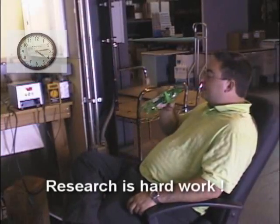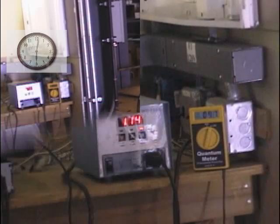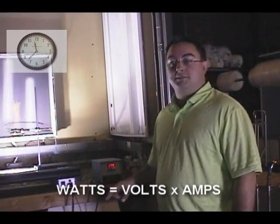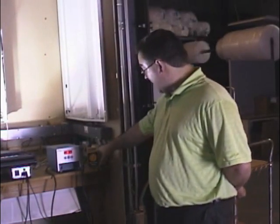After the time-lapse, you can see from the label that it's marked as 2.35 amps at 120 volts. Watts equals volts times amps, which is 282 in this case, but it's still not quite there yet — we're hovering at about 180. When we did the test yesterday, it got no higher than 182 watts, so we'll see what happens today. It seems to have peaked as far as the wattage consumption on the standard OEM ballast. It's hovering between 181 and 182, jumping back and forth, with the PAR settling in right now at 346.